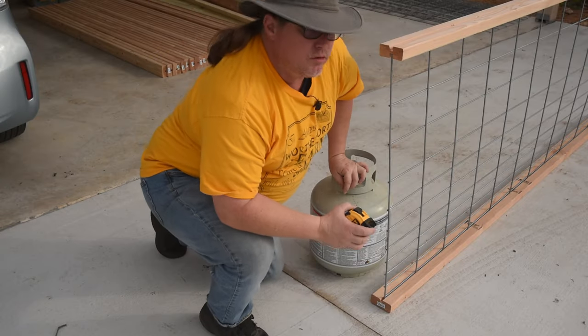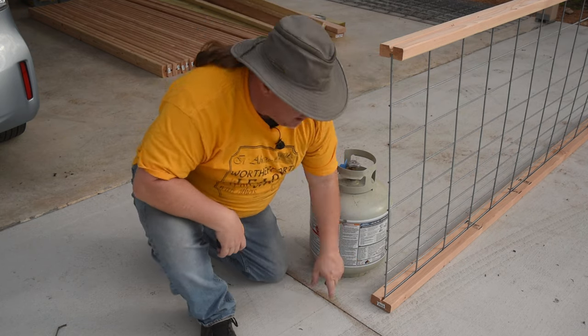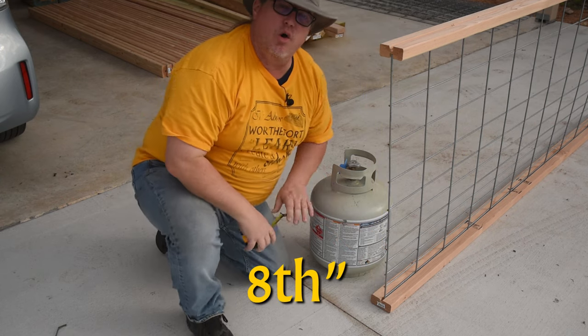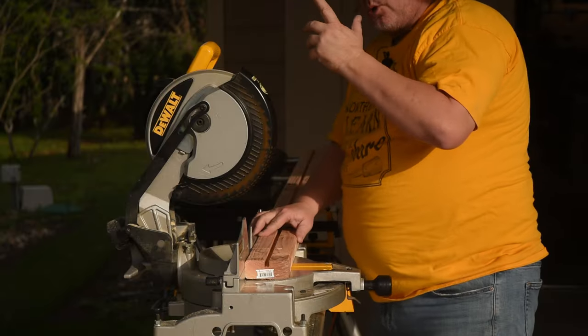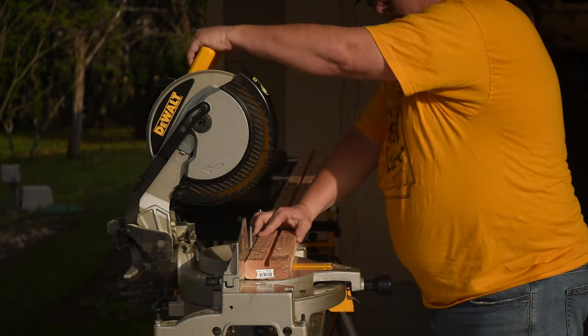So to get the vertical dimensions, basically it's just assemble one piece, making sure that you've got the panel completely bottomed in the groove, taking a measurement and adding a quarter inch to that for that planned incompetence we've designed into our system. Then you're going to want to square up the end of one of your blanks, set your measurements, and make your cuts.